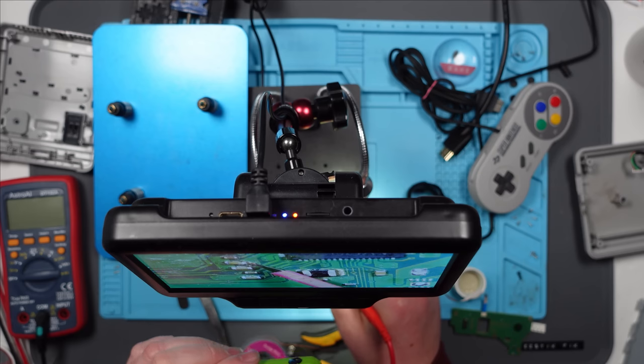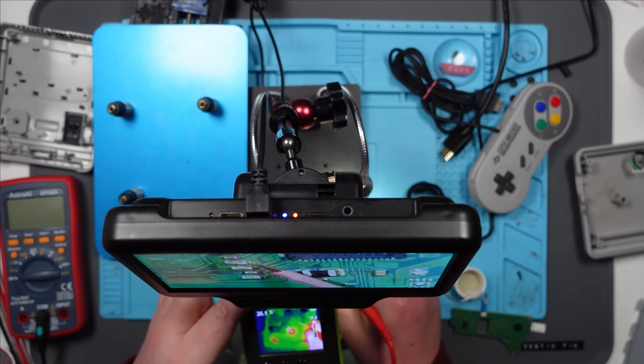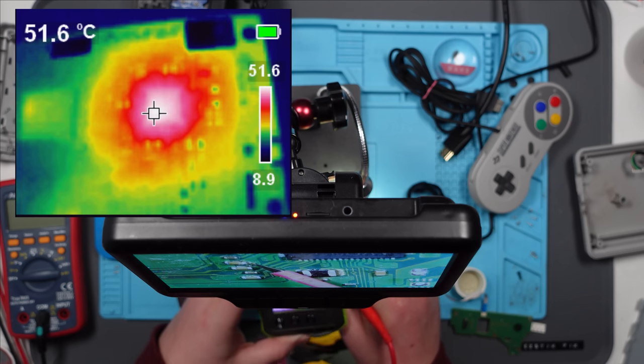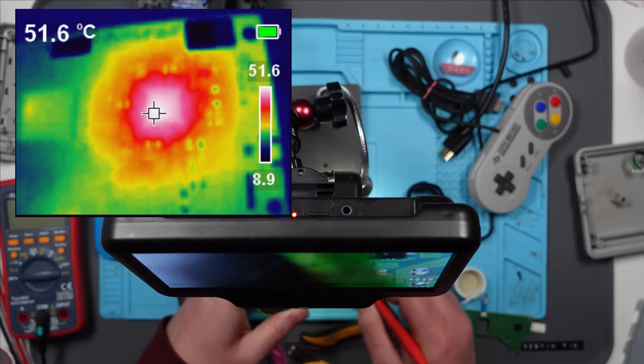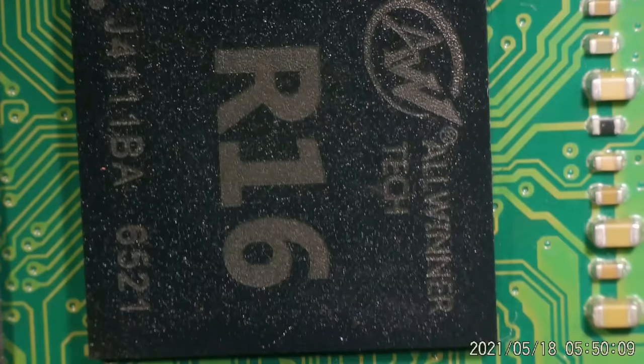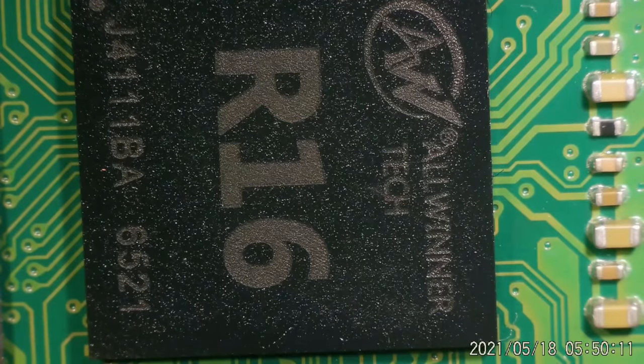Would you Adam and Eve it — the shorts have gone. Surely a bad filter could not have been causing the rest of that? Yeah, shorts are not there anymore. That filter's got nothing to do with it, but it was obviously shorted. Right, I'm just going to inject one volt into this area where the short is and see if I can see anything getting hot. So let's do it on this cap here, and thermal cam. This is getting hot here — and that is the CPU. So I'm pretty sure this is game over.